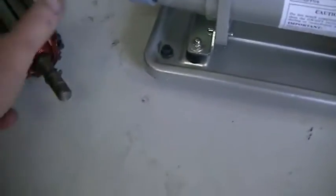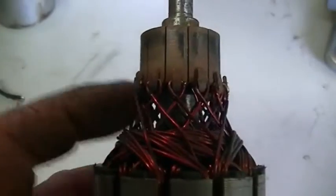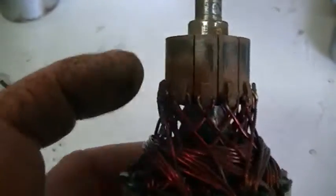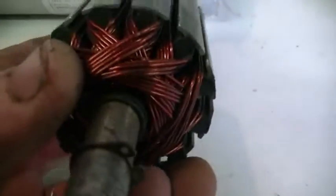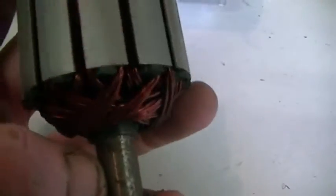So what I'm going to do is, this rotor is all good, commutator is still quite well, it's done very little work. As you can see, the brushes haven't even started touching, or haven't yet made full contact, not even bed in. So I would suggest that this is one like this, straight out of the box, that didn't work. China's quality control. So we're going to use this one, and I'm going to unwind it, and like I said, wind it with some finer wire, but make our modifications first.